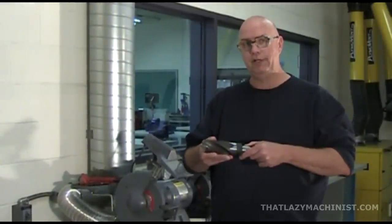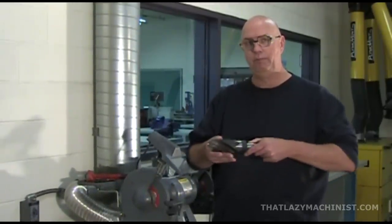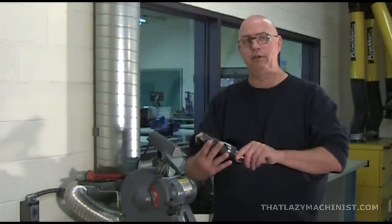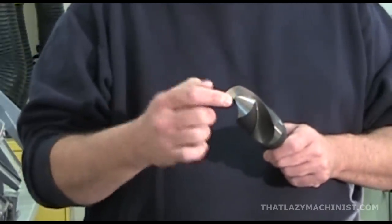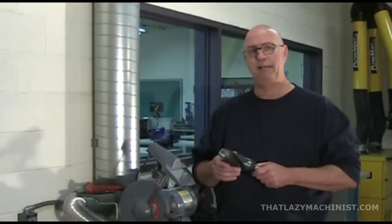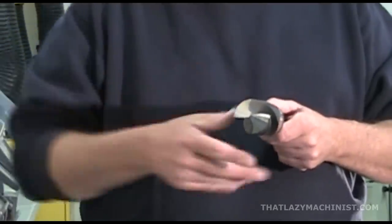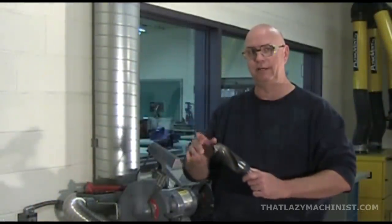You're going to push the drill into the grinding wheel and pivot upwards as you're grinding. You push and you pivot upwards as you're grinding, but it is crucial that as you pivot, you do not turn the drill. If you twist the drill when you pivot, your chisel edge is going to end up with an S form. That's going to increase the length of the chisel edge and make it very difficult to drill. So, to summarize, horizontal, horizontal, angle, push, pivot, without twisting.